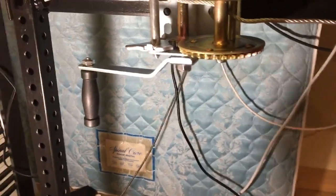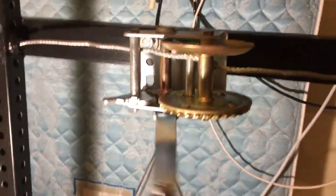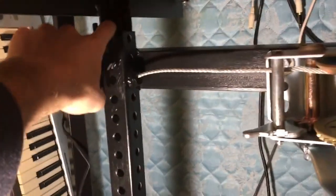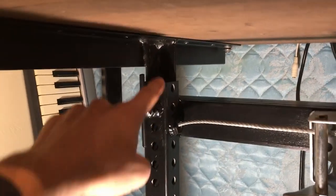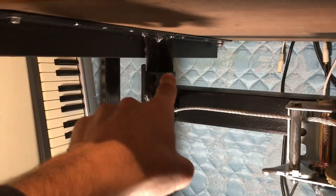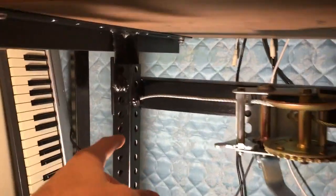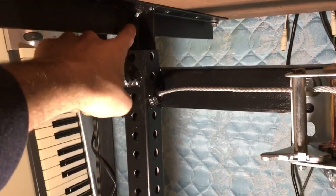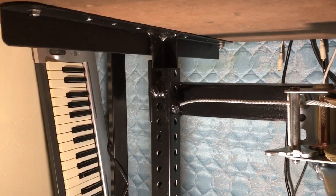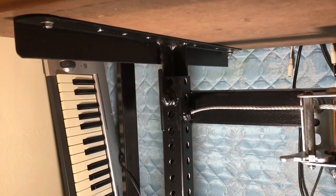This is an unbroken piece of cable, so right now it's sitting here kind of loose, but that's good because it kind of centers itself when you first start to crank on it. The reason I didn't think this table was going to work is that I thought there was going to be too much binding between the square tubing and the angle iron. So I was really careful when I attached the tabletop that I didn't put any torque one way or another on the angle iron. I don't have any lubrication between the two, so I had to be careful — but turns out it actually worked pretty well.